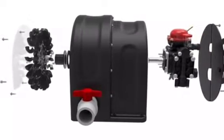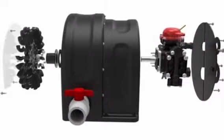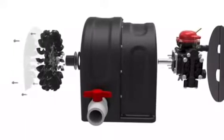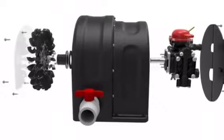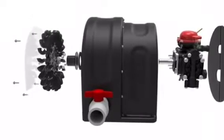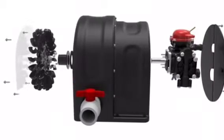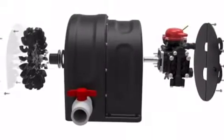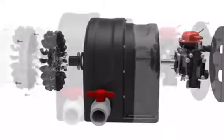The pump runs on a variable speed stroke, so it's adjustable. It runs without the need of a shock absorbing damper. The pump actually uses vegetable oil for lubrication. The efficiency of the pump is much higher than a ram pump at higher heads. The flow of the spring water is easily adjustable by the length of the rod on the pump action.